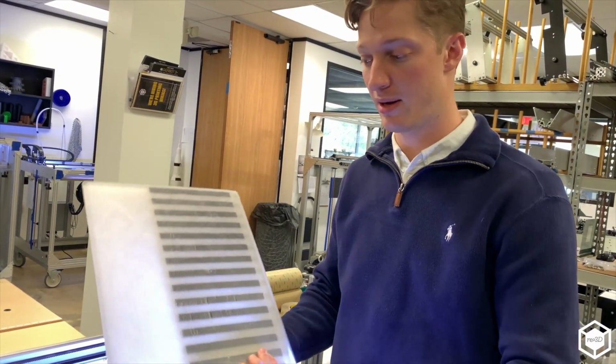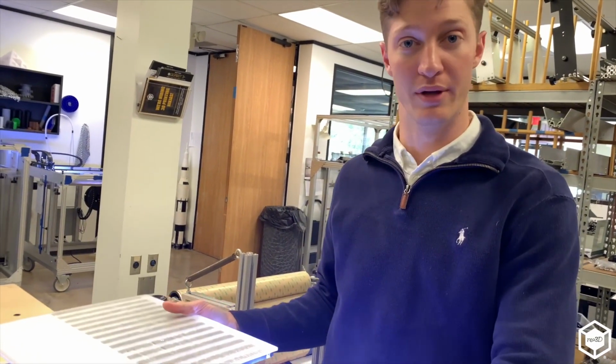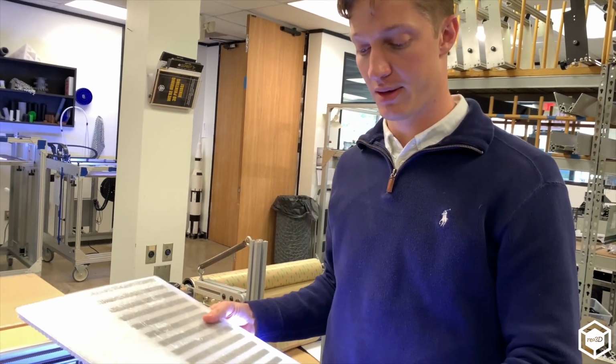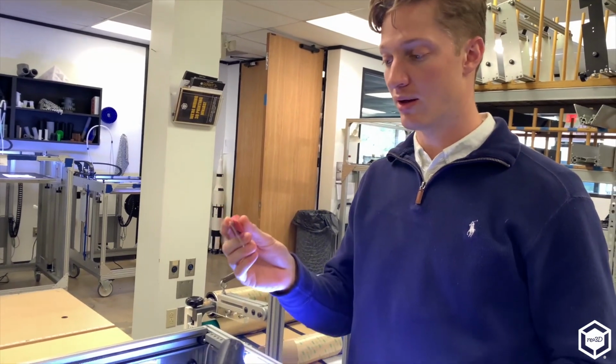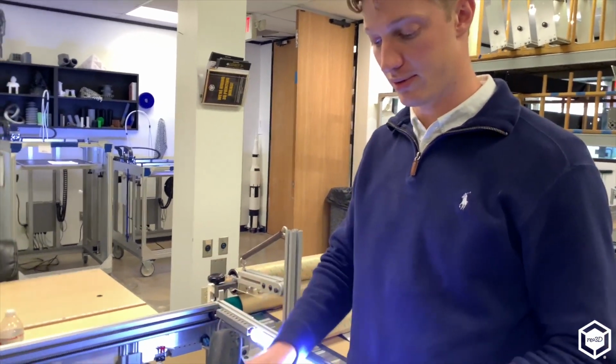So there's a lot of surface area in this bottom part, which is the reason that it gets stuck to the bed a lot. It's also helpful to let the bed cool down before you try to remove a part. But in any case, sometimes the use of a mallet with a putty scraper or a larger wedge is what you need to get the part off.